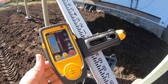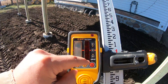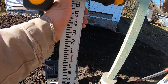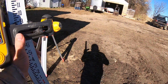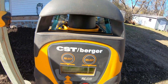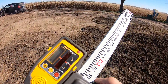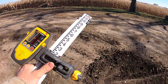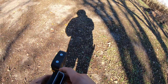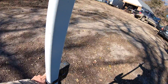Now we're going to set up this stick that reads the laser signal. You can see right here in this red box — that's what senses if the laser is hitting it or not. We can adjust this to wherever we want on this stick. What we'll do is walk over here and establish a baseline before we calculate slope. We're going to let it shoot at zero-zero, and now it is spinning. So since it's spinning, we're going to go over here and establish a baseline for where it's currently shooting at. Right there is where it's at, so I'm going to extend my pole up here.